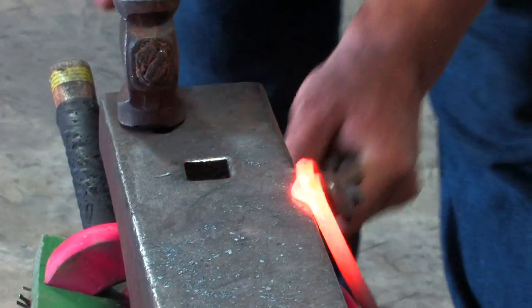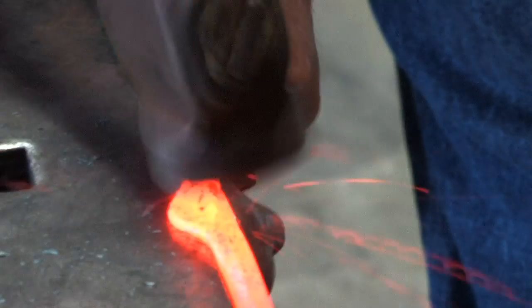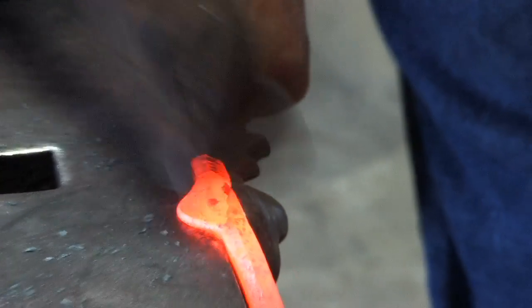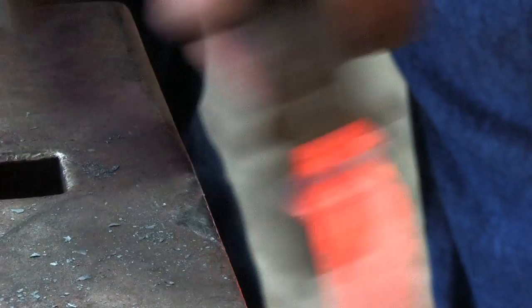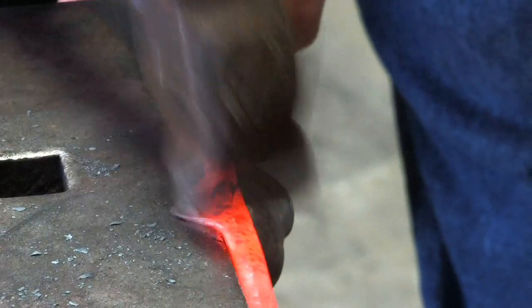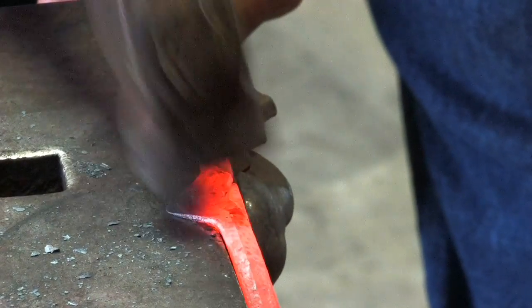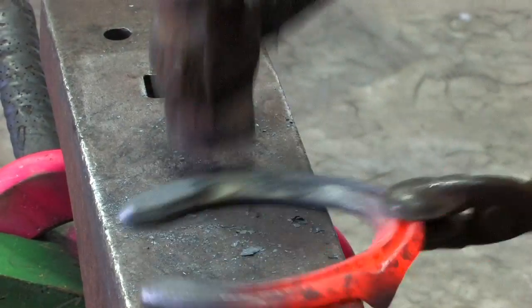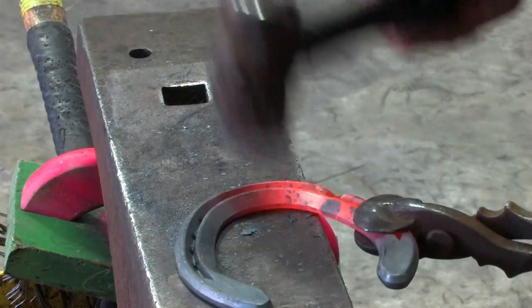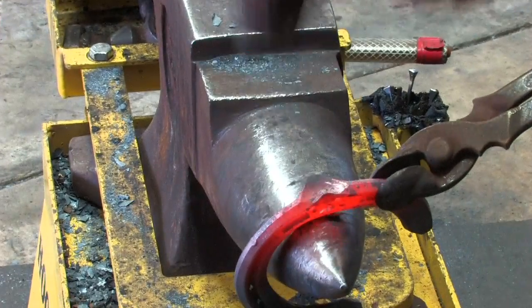This is the bob punch clip. Once we've set the base material, we can take our clip up to a point using the corner of the hammer — I'm using the back corner of the hammer going right up the middle of the material. Then I'll level behind the clip, make sure it's level, and set the clip to the angle of the hoof wall.